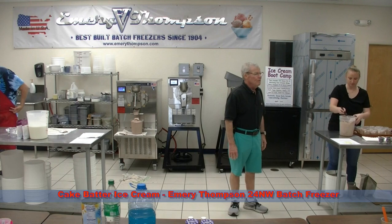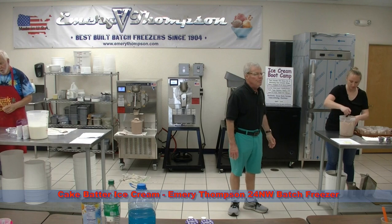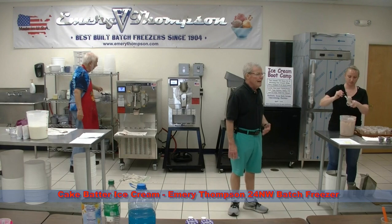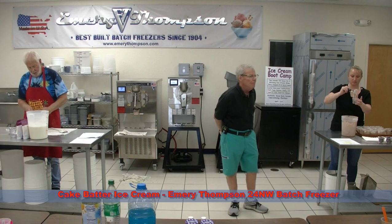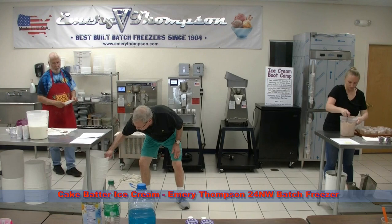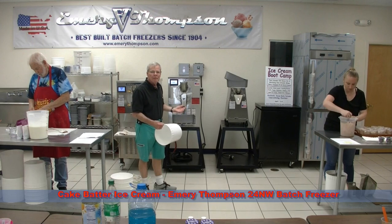You can put more product in, but it's just a law of diminishing returns. If you're going to make it in 8 minutes by putting 2.5 gallons in and getting 5 back, or 16 minutes because you put 7 gallons, and it's just so much more to freeze it, it's not worth your time. So we rate all our machines by finished capacity, which brings up a good point. Later on, you can look at the freezing cylinder over there. We rate our machines by how much ice cream comes out of the machine when it's ready. A 24-quart machine can make 24 quarts of product.